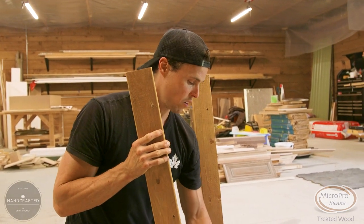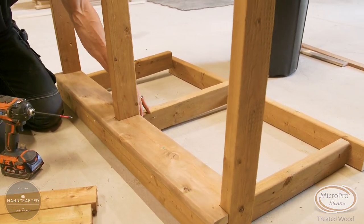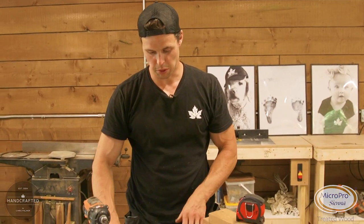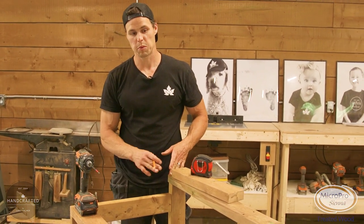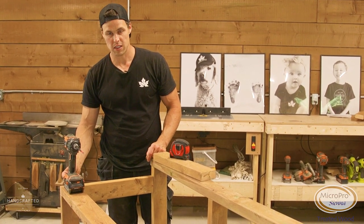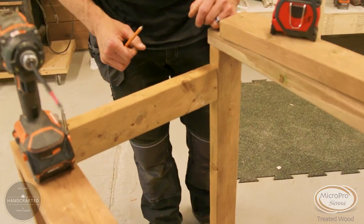What I've done here is I've notched my first piece of deck board on the base to have center-mounted the first upright in the middle. That will help me hold it in place as I go to screw it in. With the horizontal brace going into the sides, the heights are different from front to back — that's because when I put the lid on I want it to slope so the water runs off. You need to transfer that line onto the other side so when it comes across we have a nice 90-degree angle keeping our whole form square.